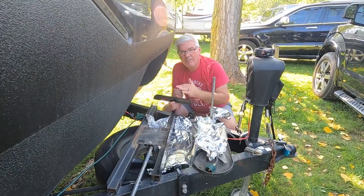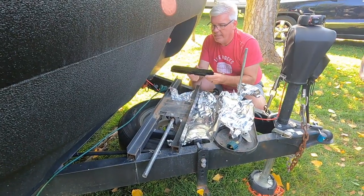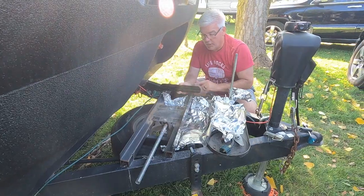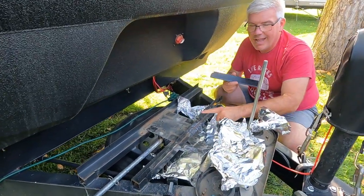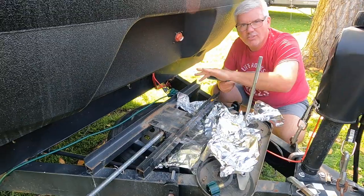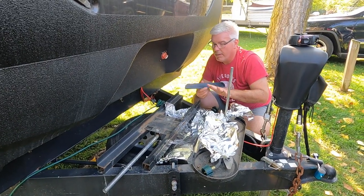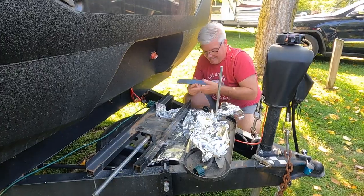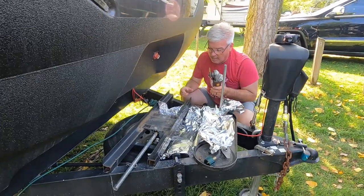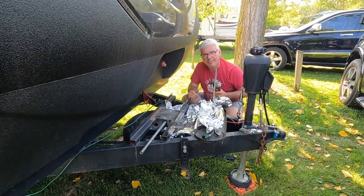In order to make the box fit into our little nook here, it won't fit because the rail is an eighth of an inch too narrow, but it does come with these little brackets to go on top. The problem with that is then it doesn't fit because it's too tall. So we are going to use these brackets and mount them down in here, but first I have to cut this railing off. I've covered all of our electrical and propane stuff with foil so that any sparks that happen to go astray aren't damaging those with hot metal sparks. Better safe than sorry. And we're camping so we're makeshifting aluminum foil. Thanks to Captain Jack Scrapper, I've got a metal grinder and I'm just gonna go to town on here and cut this little vertical rail off so that I can install those brackets. Here we go.